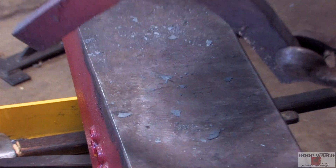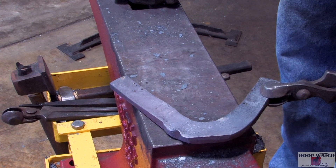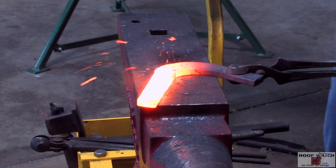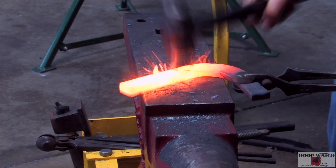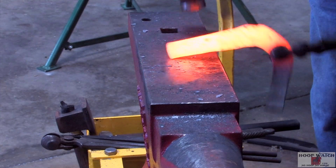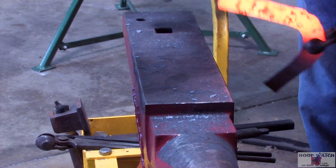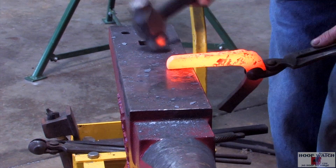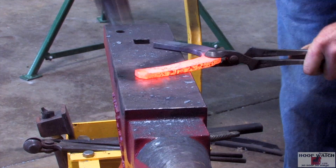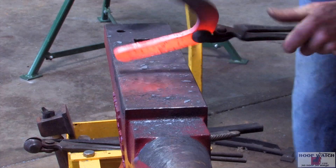Just by doing this, look how much material I got. I've got to come in and extremely flatten it out once again and reestablish all those lines one more time. You flatten it the whole time — right now I'm flattening and I'm dragging that outside edge out again. What I want to do is just start establishing that reverse heel, then flatten.